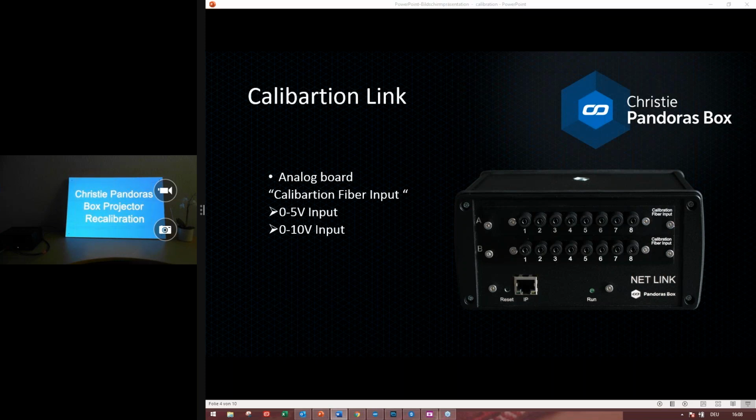Actually, these cards are analog input boards, and each board has 8 connectors. These detect the incoming voltage in specific gradual steps, providing data and information from the connector sensor. In the software, we will get a value range from 0 to 1023 if light is coming in.